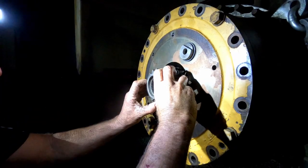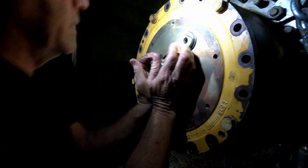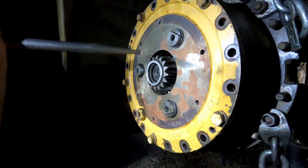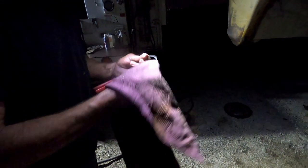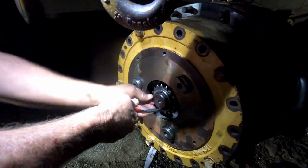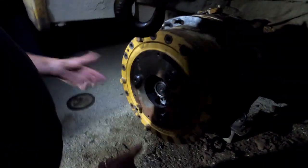All I've got to do is keep trying different spots until I see an even amount of clearance between the two upper gears — that's the spot it needs to be in. Lift up a little bit and just start it. If you just pushed it straight in, it would push the axle in and you wouldn't be able to get the snap ring in. If you tap it like this, it'll get the gear in without pushing the axle in. The snap ring is a little jacked up but it's all right — it really can't go anywhere. Once the snap ring is in place, it goes into that recess and it's captive right there.